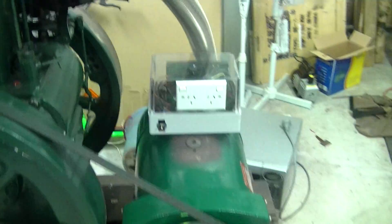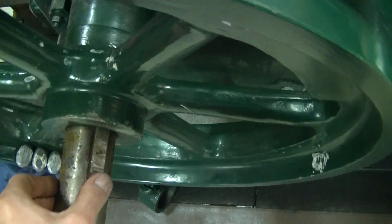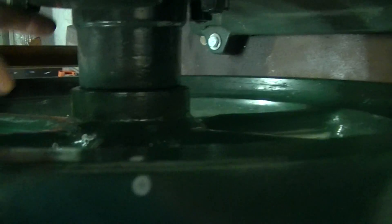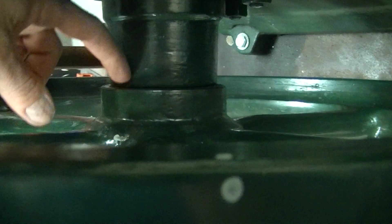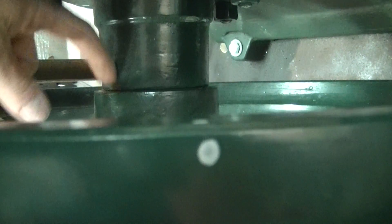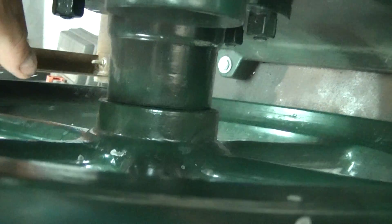Next thing I need to do is pull this flywheel off. I've got to make a good key puller out of steel — I smacked this one in and it's just not coming out anymore. When they put the flywheel on, they didn't leave a gap, and it rubs on the TRB tapered roller bearing seal, which is not good — it'll chew that away in no time.